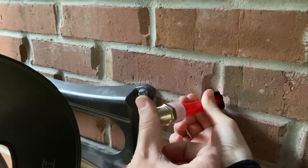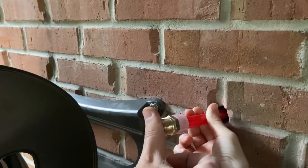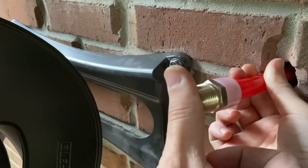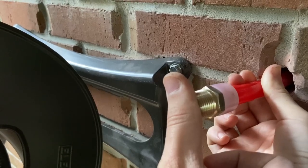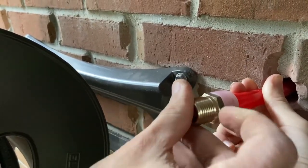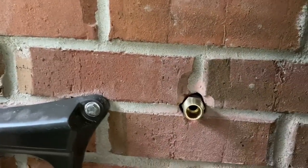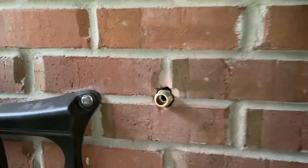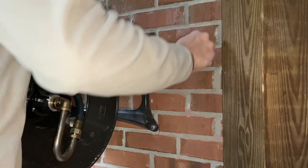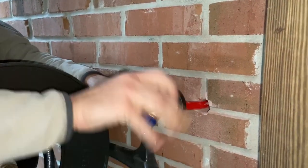Within 15 to 30 seconds the fitting will be secure. You can see the fitting is seated all the way against the PEX sleeve, and we hold it until it clamps back down. Once that installed pipe thread fitting is in place, we apply Teflon tape to make a stronger connection and thread on the hose spigot.